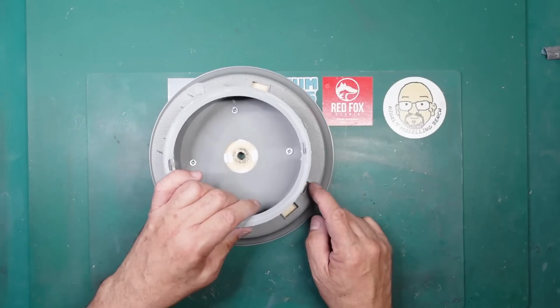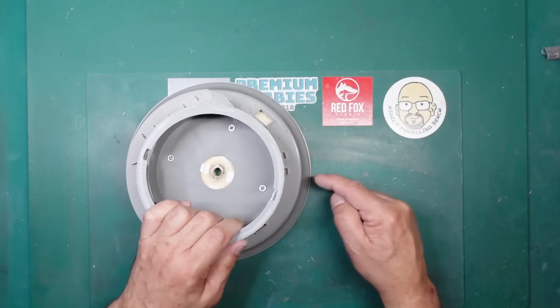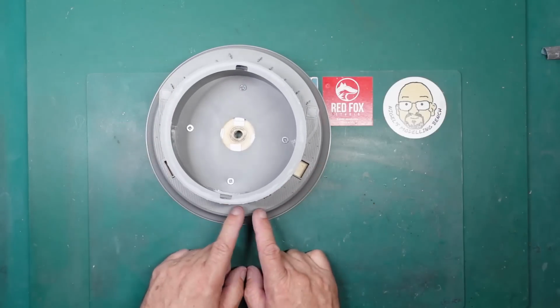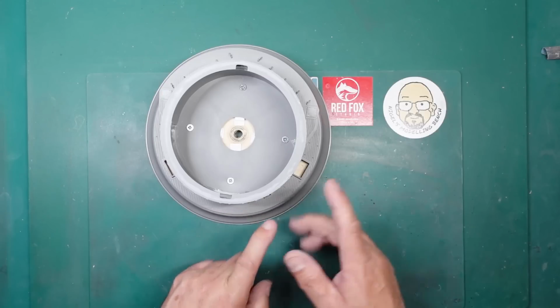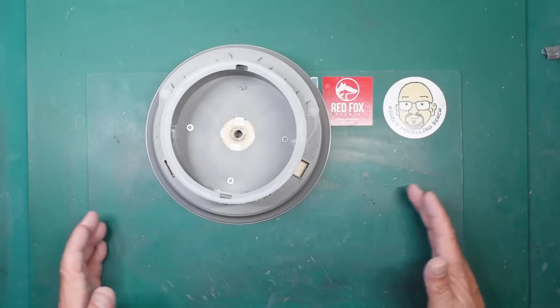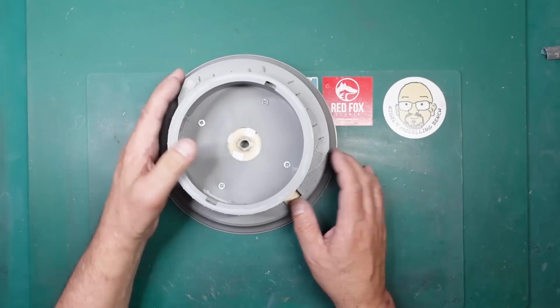It's going to be really difficult with this one because there are no joins in the planks. It's all just planks. So we need to be really careful that we don't end up with one colour, one colour, one colour, just this sort of staggered pattern, like a piano keyboard, with a constant repeating pattern. We don't want that. We want it to be very, very random. So I have to be a bit careful with that.